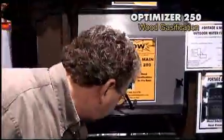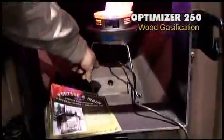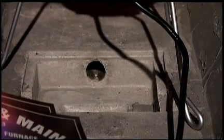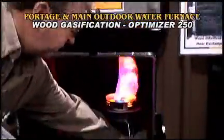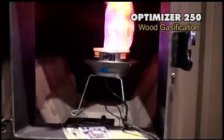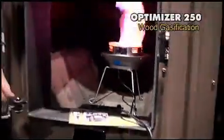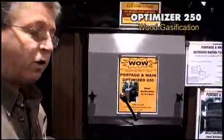All the smoke has to go down through this hole in the center. There's a nozzle that directs all the smoke through there, so the only way out is through the hole in the bottom. We introduce air through these six holes on both sides, and the air comes in preheated through the refractory brick. The refractory brick is in there so it will reignite and gasify again almost instantly after it's been in the down stage, cycling on and off according to the Aquastat.